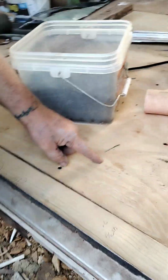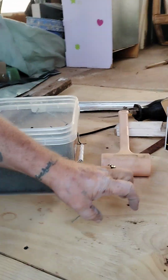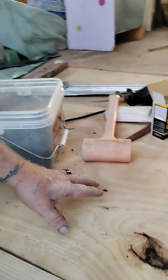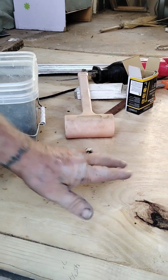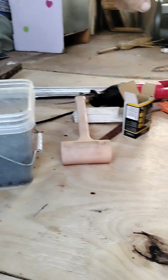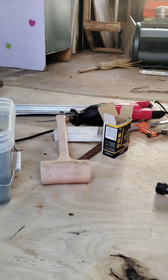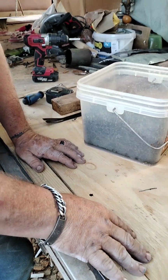took the subfloor that was rotten here from water damage. I took both the upper and the lower subfloor completely out. We put new OSB board in here, and I took a 5/8 piece of plywood and went over top of that to create the new floor. It's got a little bit of gap, a little bit of lip, not bad. It's manageable. It's as close as it's gonna get.